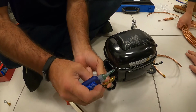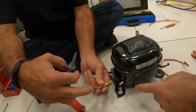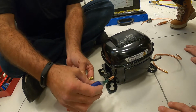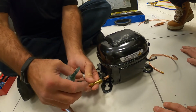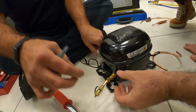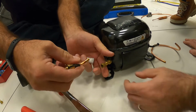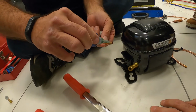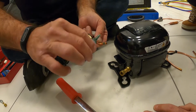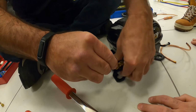First of all, if you do a connection that's a little bit vertical like this, you want to apply this first and then play with it. Do not apply it completely at the end, but a little bit farther back, and then play with it a little bit. Oops, lost my glasses. So it penetrates in. Same thing here. You would like to drop it here. A nice big drop. And then enter it and rotate 360.